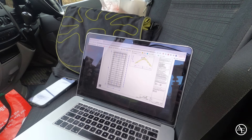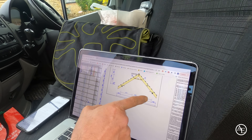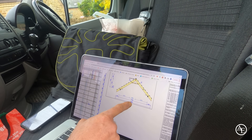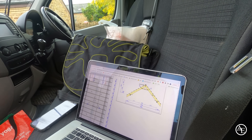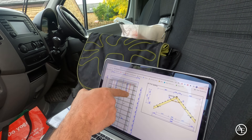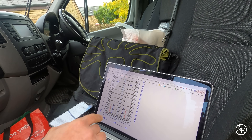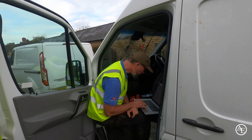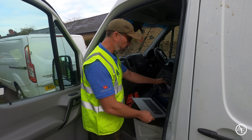This is the truss drawing - I'll zoom in so we can see what's going on. You can see the bird's mouth here and here. We've got a measurement outside of plate to outside of plate - overall is 3780, and the overall span is 4680. It's a 40-degree pitched roof with some big timbers for a vaulted ceiling. Moving across the plan layout you can see hangers and bracing running up and down to keep the roof nice and stable. All the trusses are set out at 600 centres with a clip system. So we're going to crack on, get tools set up, get it all marked out.